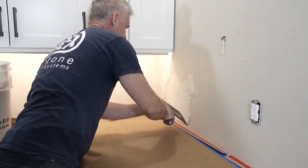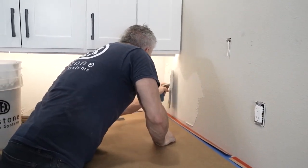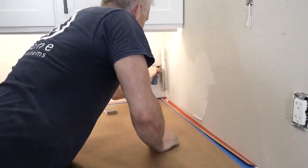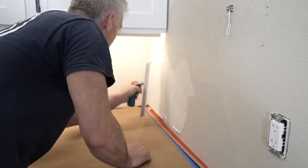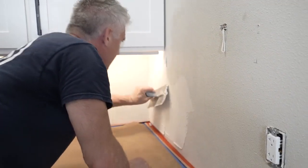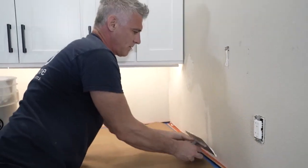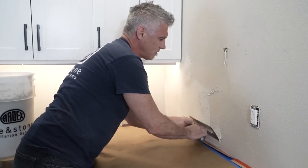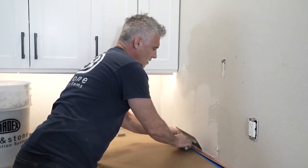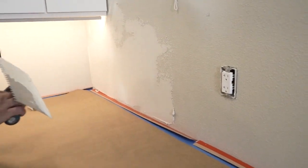You're just trying basically to get that to adhere to the wall first. This is called flat troweling. You're just trying to get that to grab the texture in the wall and do as much grabbing as it can. What we're doing is forcing the mortar into the wall so that we have a proper bond.